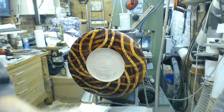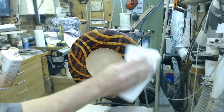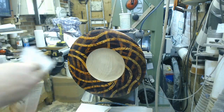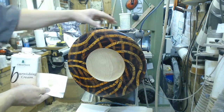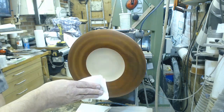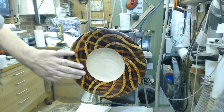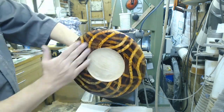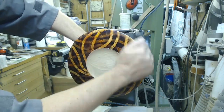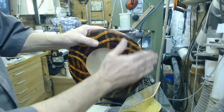Now, this has not been one of the world's greatest lacquering efforts, and it's only been drying a couple of hours at most, but the camera waits for no one. So here we go — just bringing a bit of burnishing cream to bring it up to a nice smooth, even shine, and I'm almost putting no pressure on the paper. That's brought the sheen back down and it's a bit more uniform — there is a nice shine, you can see things being reflected in it. The middle is a mess, needs a sanding, so I'm just going to do that quickly, and I might even get this posted before the end of the weekend.